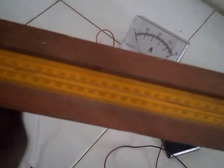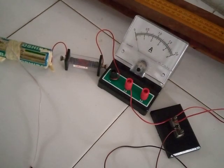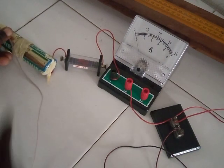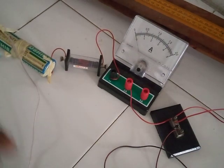This is the positive terminal of the cell — you can see this wire connected here to the key, with the other end terminated at this positive terminal. The negative terminal is terminated to the resistor, and the resistor is connected to the negative terminal of the ammeter. What I intend to do is to close the circuit and read the current without connecting it to the potentiometer, so I can determine the internal resistance of this cell.